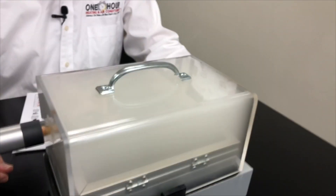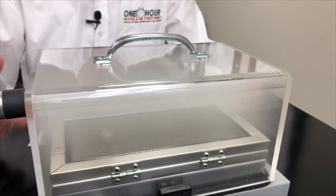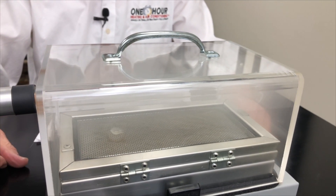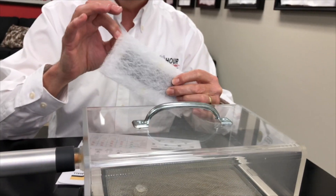The Micropower Guard is actually an air cleaner — it's not a filter. It looks like a filter and has fiberglass media in it, but how it's different is rather than just collecting dust on the surface, it puts an electrical charge on every one of those fiberglass strands, and particles stick to it like a magnet picks up metal filings. It sticks to it rather than just trapping it.